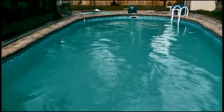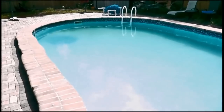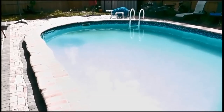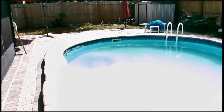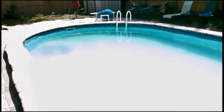It's the next day — the filter's been going for about 18 hours now. The pH is down to 7.4 and the cyanuric acid was still a little low at 10, so I put a couple more pounds in. This is a 15,000 gallon pool. I've swept everything from this side of the pool down toward the one skimmer where he has suction — that makes vacuuming a lot easier. As you can see it's cleared up even without shocking — it's already cleared up. I'll have Marco shock tonight and we'll be back tomorrow to see what's going on.